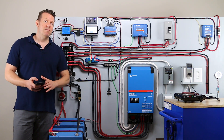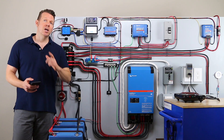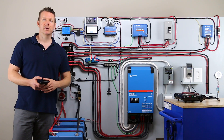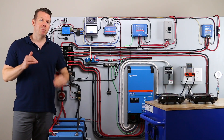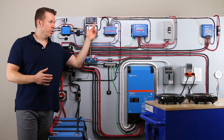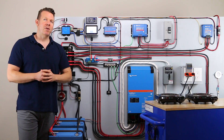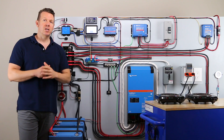To get a great weighted average, I'm going to add a second stove — we're going to take it up to 2,000 watts and get the efficiency there. We'll take our weighted average and give you a number you can plug in to get dead-accurate calculations for an inverter like this to size your battery bank appropriately. I did recharge the batteries back to the same level as the previous test for an apples-to-apples comparison. I want to warn you, 2,000 watts is going to overload our little Kill-a-Watt EZ, but we want to get this final measurement.